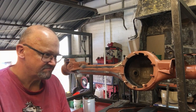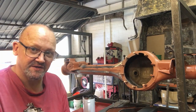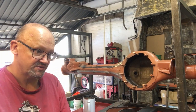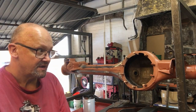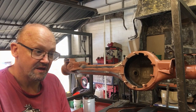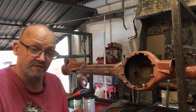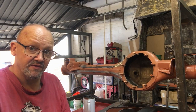Now, they actually say in their description, depending how you read it, that the top bends, the bottom doesn't. Well, I can't see how that can be possible. But they also say that it's only the long that bends, not the short. I kind of go with the army, really. And if you look at the Wolf Land Rovers, they're boxed in on both sides. So obviously they discovered they needed strengthening on both sides. So I'm going to go with that.